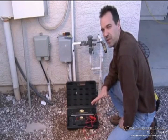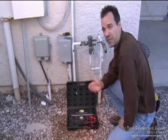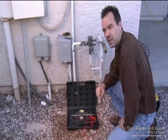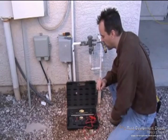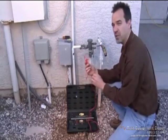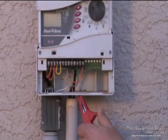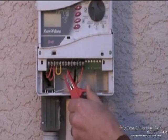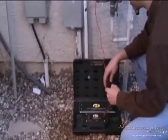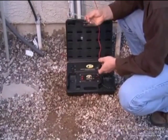The Pro 300 is a residential wire and valve locator — that's what we're trying to do with it: find wires and valves around residential locations. To set up the transmitter, connect the red alligator clip and lead to the wire you want to track. Go to the clock, connect to station one, and take the other alligator clip and connect that to ground.